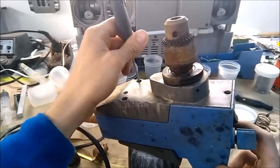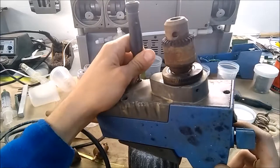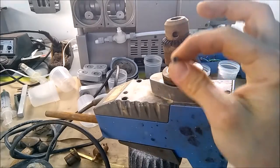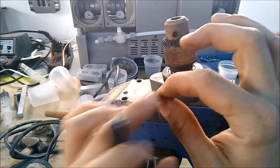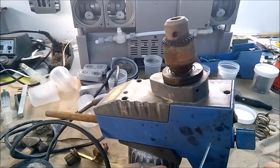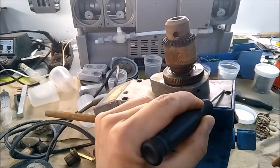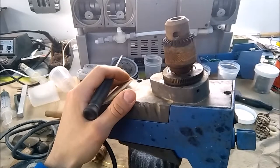I've already replaced the back two screws with stainless. When they come stock they come with these really flat-headed T10 — M3 T10 screws — and they're a pain because they corrode really easily. Because they're Torx and really flat, if you try to put a screw remover in there they just strip off. On this one I've had to drill out the front screw, then made a little jig for the drill press, cleaned it out and re-tapped it.